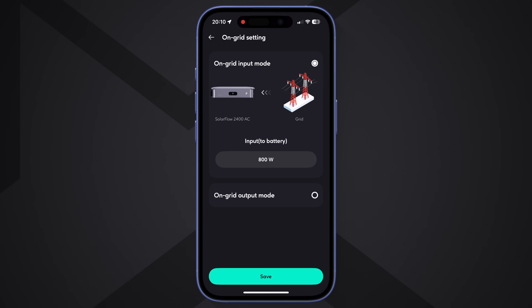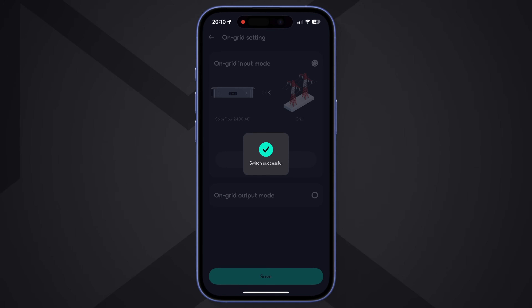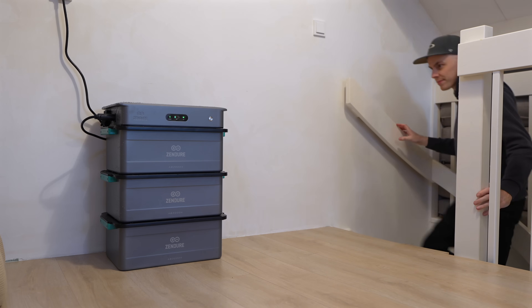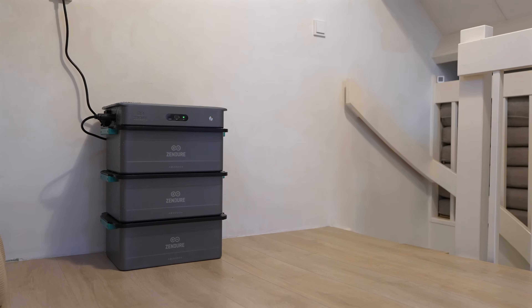If you want to use the full 2400 watts, you need to set that in the app and use a dedicated circuit. In my own setup, the system is in the attic on a very light circuit with only two small LED lights. So while it's technically not a fully dedicated group, I'm comfortable enough to let it run at 2400 watts. There's also a bonus to that placement — if we ever need to move upstairs in an emergency, such as flooding, the backup power is already exactly where we'd want it. The key takeaway is simple: you don't need a perfectly isolated circuit, but you do need to understand what's on it.